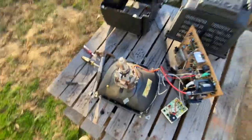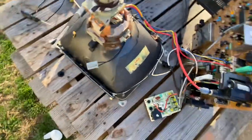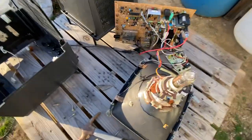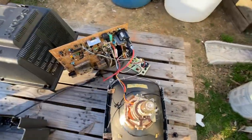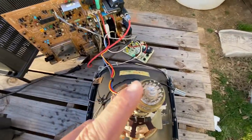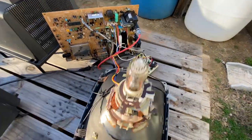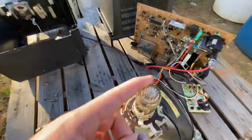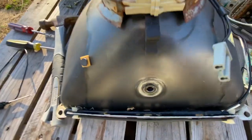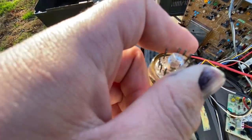What's going on guys? So this is a Sony Trinitron 1999 CRT TV and this TV unfortunately has issues. The issue it has is there's a crack in the neck of the tube which is causing air arcing. As air goes inside the tube it's arcing on the inside of this Electron Gun assembly. I'm just going to show you where the crack is.